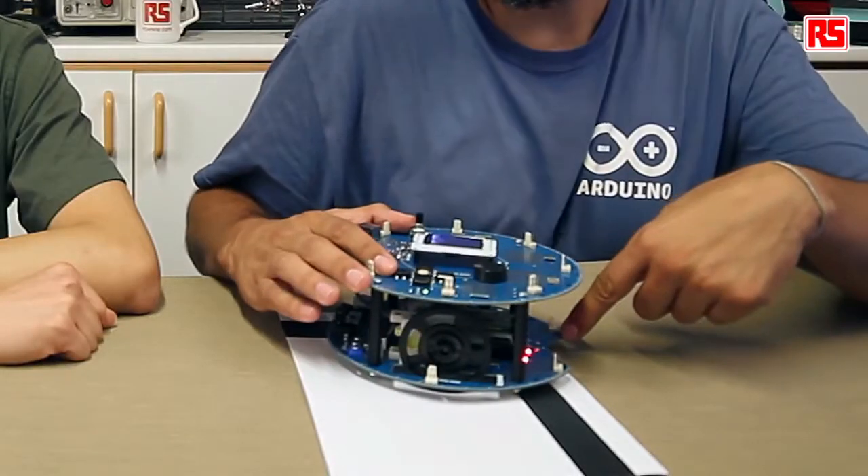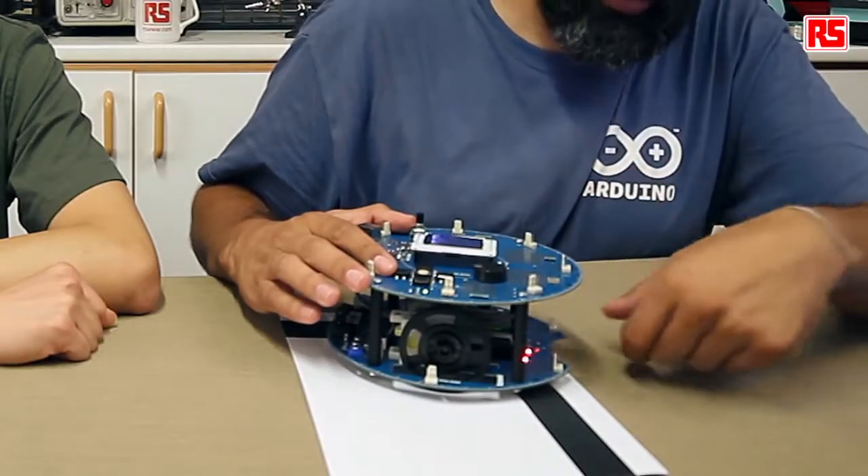See what happens when you turn it. As soon as the sensors reflect the light on a black surface, the shadow makes the sensor get activated and it's indicated visually here. This is just a digital indication. In reality, the infrared sensor gives an analog value that can be analyzed to determine whether the sensor is closer to the margin or more at the center of the line.